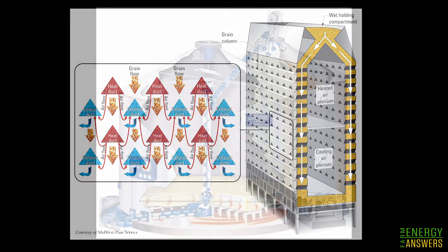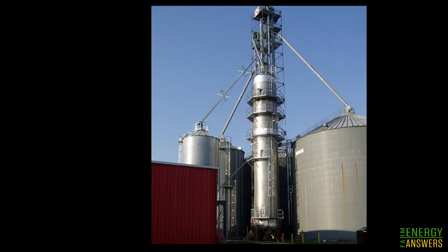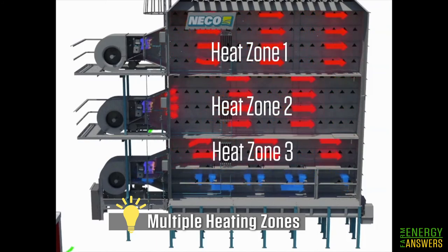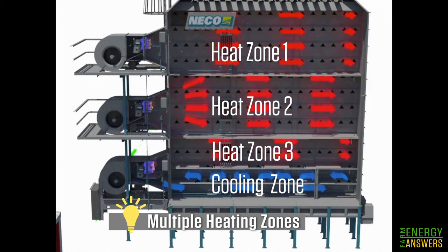Mixed flow and continuous in-bin dryers are the most energy efficient continuous flow dryers on the market. If purchasing a cross flow dryer, it should have grain exchangers or inverters and have heat recovery or be used with a dry aeration system. Heat recovery can reduce energy costs by 25%. Dryers with multiple heating zones can allow the drying temperature to be optimized, especially if the corn is wet. This leads to lower drying costs.